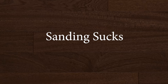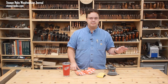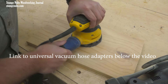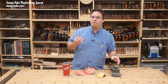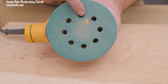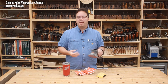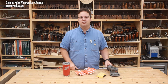Modern sanders often come with all sorts of gimmicky dust filters and bags that promise to clean the air — it's mostly nonsense. There's a reason why professional sanders don't come with a dust bag: pros know that dust bags don't work. You need a shop vacuum or a dust extractor to pull the dust off the surface of the wood while you work. Collecting that fine dust isn't just about avoiding buildup in your nose — it's also about improving the quality of the finish, because fine dust and even loose bits of grit from the sandpaper can form into little lumps beneath the tool and leave deeper scratches and swirls. So regardless of what sander you use, cheap or expensive, toss the filter bag and at least attach a shop vacuum.